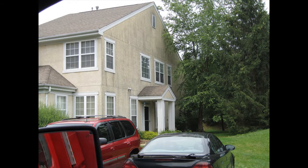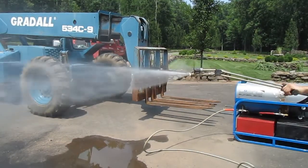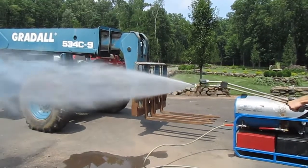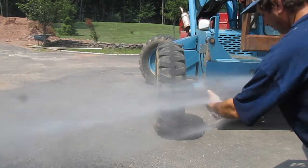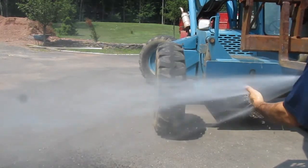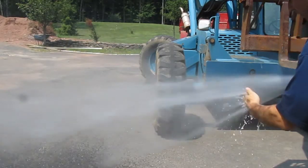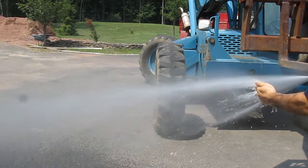The big question every time with these roof cleanings is the power washer. We are not using this machine anywhere near its full power — it's simply being used with a wide fan spray at a low setting, which isn't going to hurt the roof any more than a hose, which a lot of places recommend. We use less water, we use it more effectively, and we clean more effectively. This has been done on thousands of roofs with no harm.